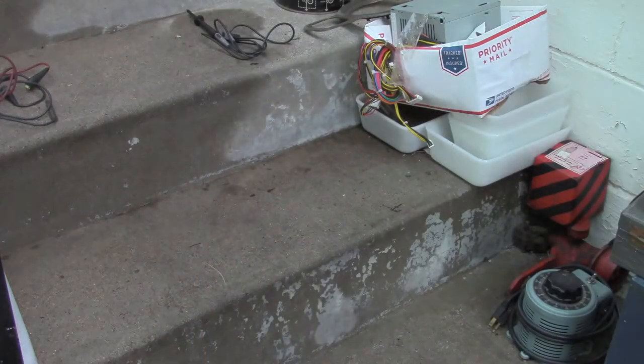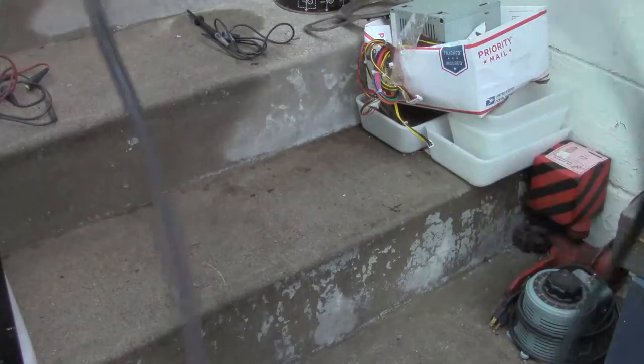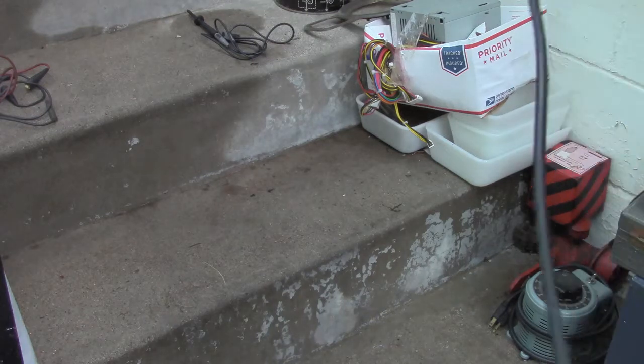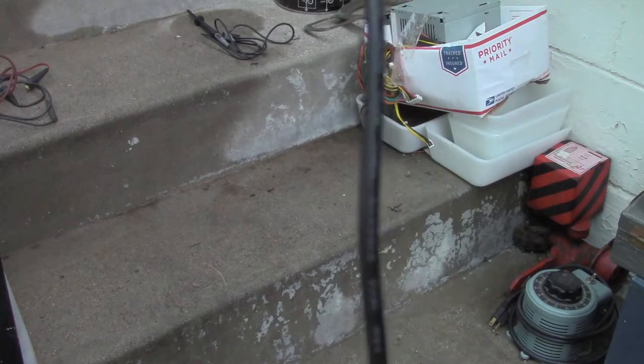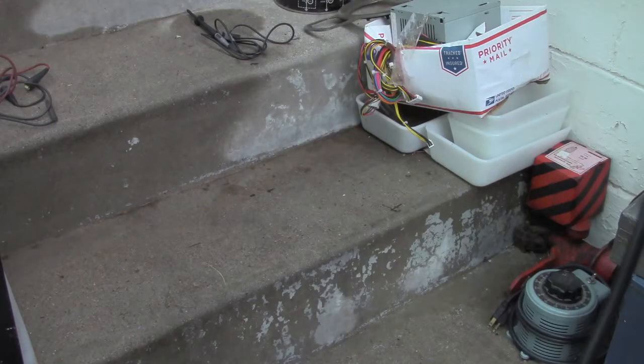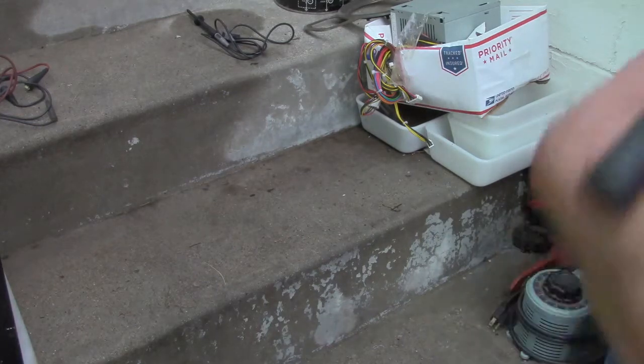There are some clever styles, but all these say 10 amps. Well, this is, I think, 18 gauge wire, or at least it says it is. It says it's rated at 2,000 volts. The manufacturers can put anything on there — just because it says that doesn't mean it's true. If you're really going to use this where it might be critical, you may want to test that.